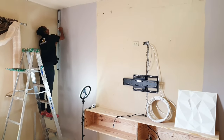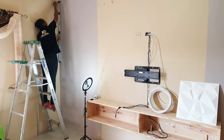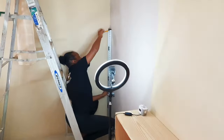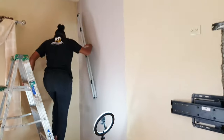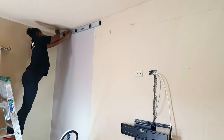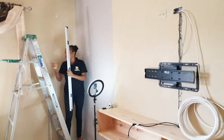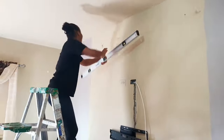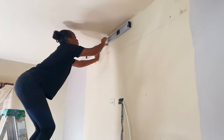I started off my project by using my level to draw a line at the side of the wall. One of the main reasons to catch a level line is that I can guarantee you that these walls are definitely not straight. I'm also drawing a level line at the top just to see how much off-level these walls are.